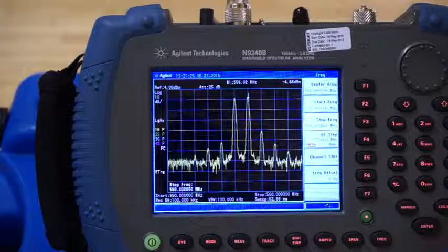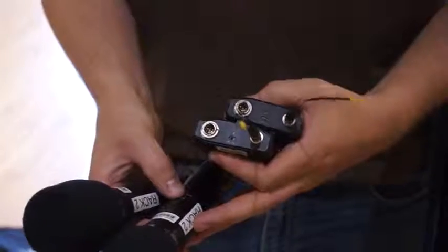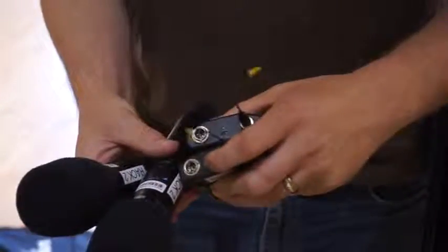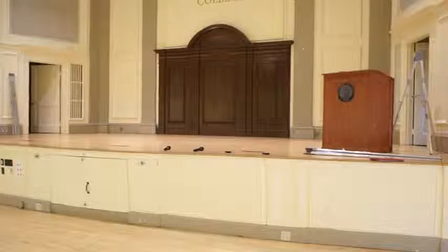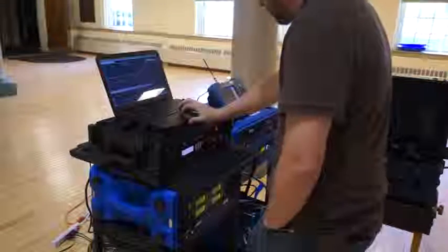What you can do is program your system so that none of your center frequencies fall on any of the intermods. That's easy enough with 2 signals. But things start to get complicated once you have 3 or more transmitters in the same area, like on a stage. So complicated, or rather tedious, that you need the help of a computer.